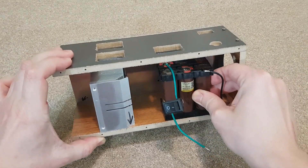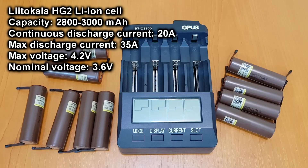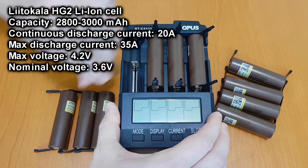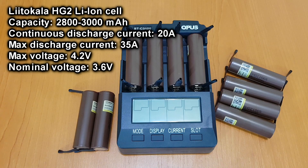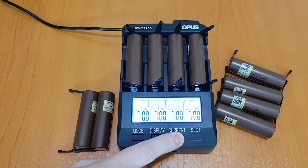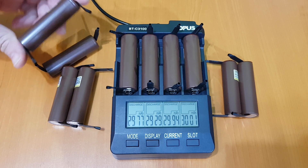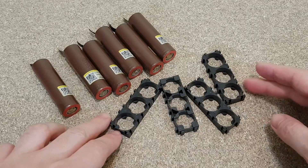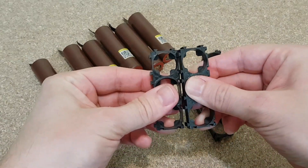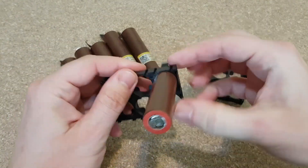Now I will make some measurements and decide where I will install all the components. Let's talk about the battery pack. I bought these high drain lithium ion cells — they have a continuous discharge current of 20A, which will be very useful for this project. First I want to test the cells with my Opus charger. After a few cycles of charging and discharging with 700mA, we can see that they have a very good capacity — these are good cells. We need some simple plastic holders to make the battery pack. I still don't have a spot welder, so I ordered the lithium cells with nickel strips already attached — it's easier to solder them.